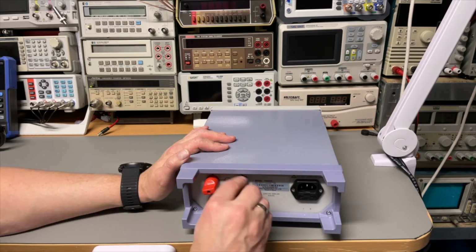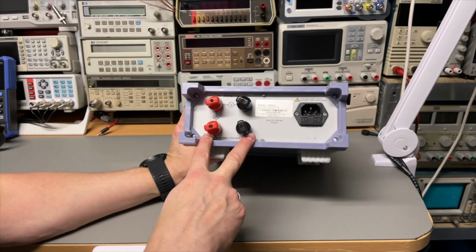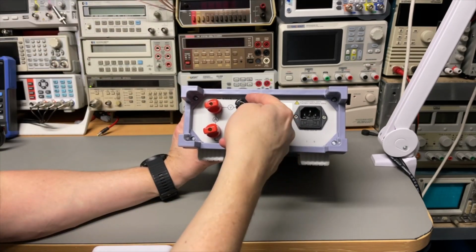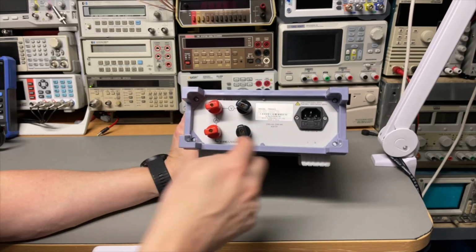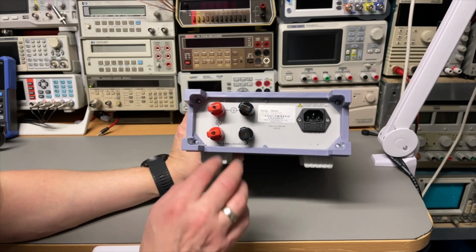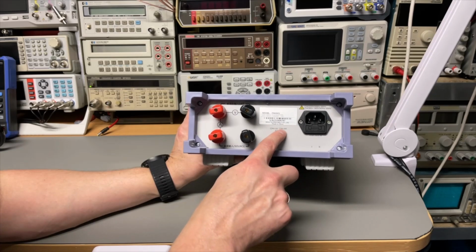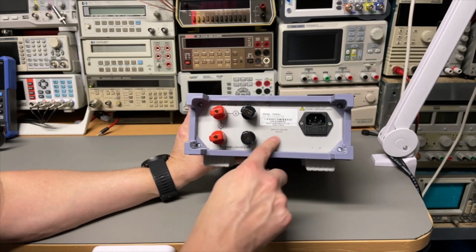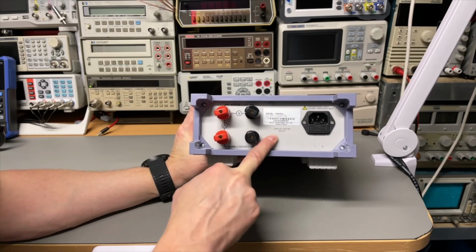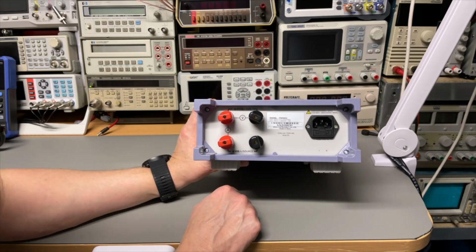So I need to connect my source right here, and my load goes right here. And I'm not sure I need to connect those, because here is the amp meter, or this is already done, so we need to see. That is probably in the manual, how to do this. There is an option for RS232 or RS485. I don't see it, but I can feel that you can add here a 9 pins connector, so probably it's just TTL to serial, so maybe I can just do that myself later. That would be interesting.